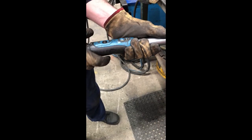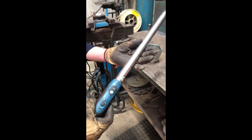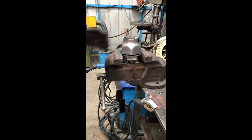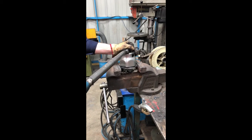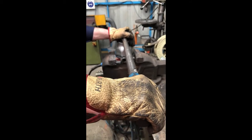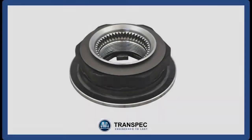To test the self-torquing axle nut, remove it from the hub and grip the metal base of the nut in a bench vise. Set a torque wrench on 110 Newton meters and, using the 95 mm axle nut socket, turn the hex part of the nut in a clockwise direction. If the self-torquing nut needs replacement, then the nut should slip and click before the torque wrench does, indicating a lower torque achieved. Any self-torquing axle nut which fails this test must be replaced.